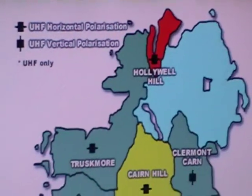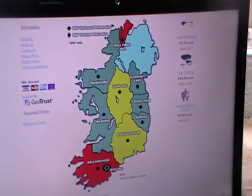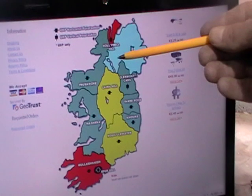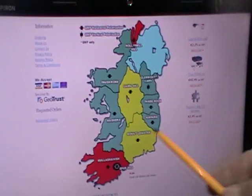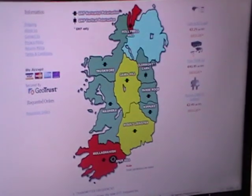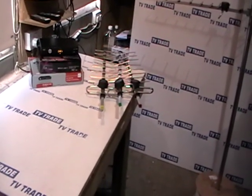In those particular areas you could use a wideband aerial, but if you're sure of the transmitter you're going to be using, you could use a color-coded one such as green-tipped. It's slightly complicated by the fact that there are a number of substations not shown on this map, which can confuse the situation a little, but these are the main transmitters in Ireland. The vast majority of people will be picking up from one of these transmitters. Hopefully this gives you an overview, and all the aerials we sell on tvtrade.ie are digitally compliant.